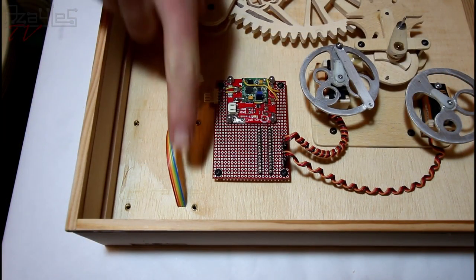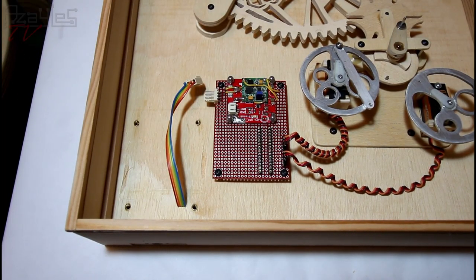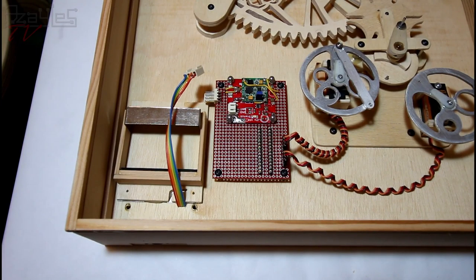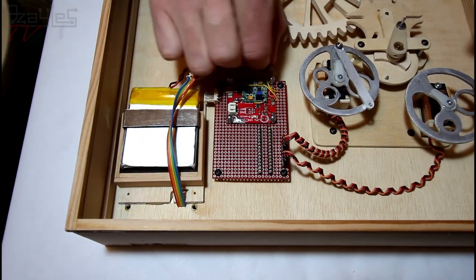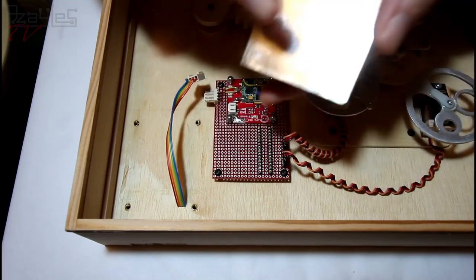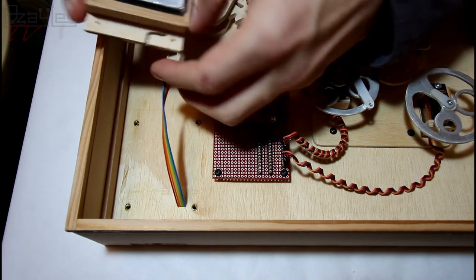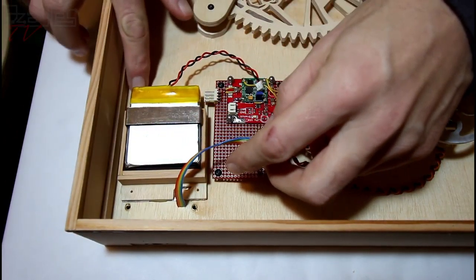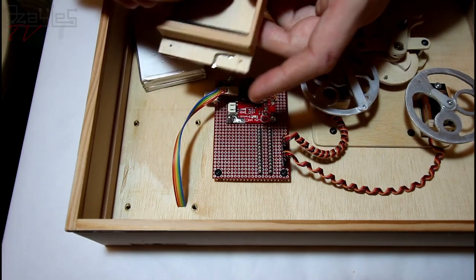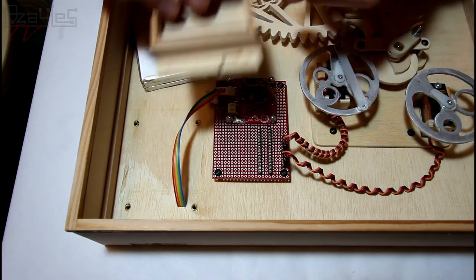Finally, now notice I've got brass threaded inserts in these parts, one in each corner, and that's for the battery holder. Now that's going to go in here, down in there, about there. Battery goes inside that, and everything plugs in. But what I've had to do is put a metal plate on the back of this, because when I put the battery in, it will cover up where the screw holes are on the top. So I'm going to drill the holes down to that metal base plate, so the screw will be countersunk, and these screws will just go through as normal, hold everything down.